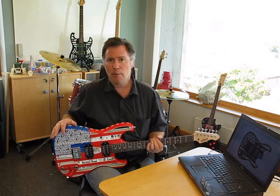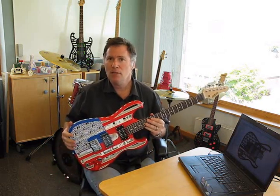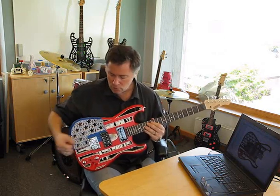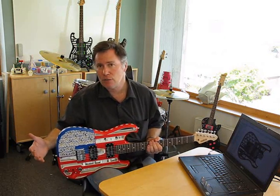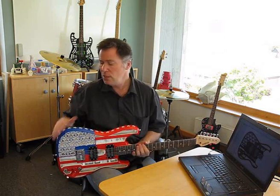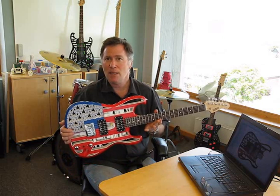So possibly a good place to start would be to point out a few things about 3D printing. Though I talk about these guitars as being 3D printed guitars, really they're not. They combine just about every manufacturing process under the sun. The necks are CNC machined, the inner core CNC machined, the bridge is cast, all the plastic bits are injection moulded. So this actually forms a really good example of showing how 3D printing is not going to replace traditional manufacturing — it is a complementary technology that, if you use it in the right way, can be very, very advantageous for certain types of components. In this case I use it because it allows me to make incredibly complex parts that you couldn't make any other way.